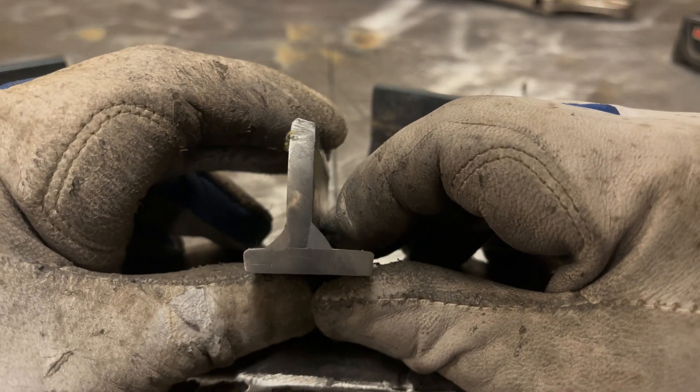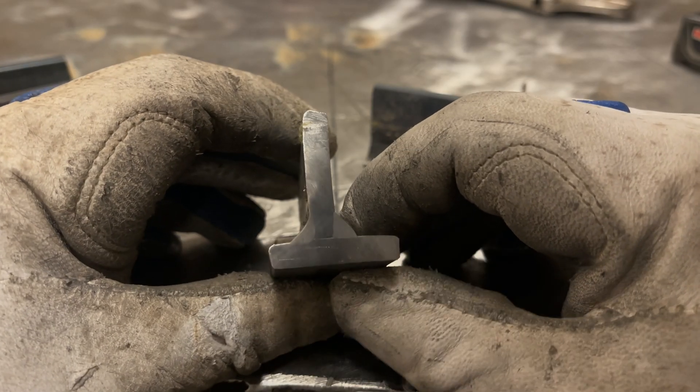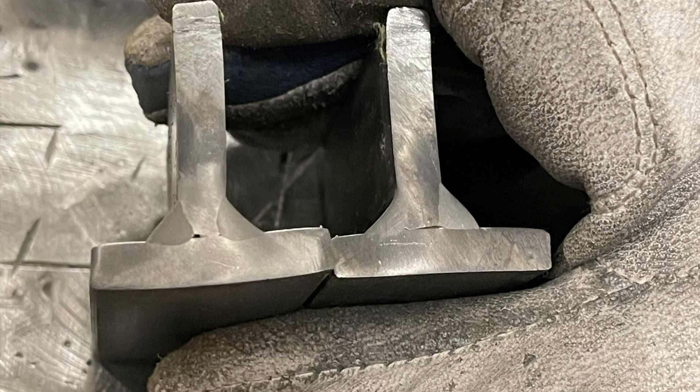Putting up a picture of both plates together, these results are interesting. The weld on the left — run with lower values for both wire feed speed and voltage — actually penetrated more. It almost seems like the weld on the right was widening out and the throat depth was increasing, but it wasn't actually biting in more. There is a practical limit before you start losing penetration. I'd rather have the weld on the left overall, and this really drives home that just because a weld looks a certain way, or you increased your settings, doesn't mean the root penetration is better. That's the importance of cut-and-etch testing.